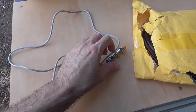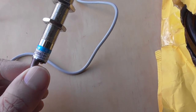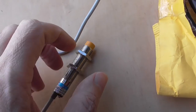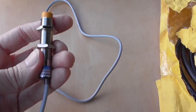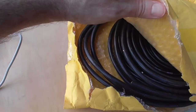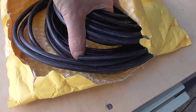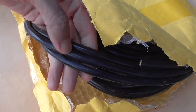I haven't put the limit switches on yet because I stupidly bought the wrong type — I thought I was buying normally closed, but when I checked the listing it says NO (normally open). I could use these, but they don't cost much so I thought it'd be better to just get normally closed ones — they'll be a little bit safer. I also bought a three-wire shielded cable that was a little bit too short, but that cable has arrived now and I've got heaps of it.